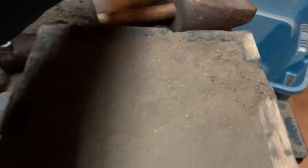I've got everything smoothed out the way I want it. I'm not too worried about getting it perfect here because that's where the two pourings come in — I'm going to do two, maybe a third, we'll see when I get it apart. I'll put the top on, fill it full of sand — I honestly forget if it's the cope or the drag. We'll fill it in, release it, then come in and put my channels in. Long as it releases from the top, I don't care how it looks because it's all going to get dug out anyway.